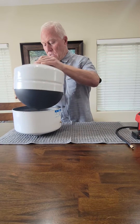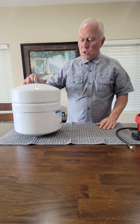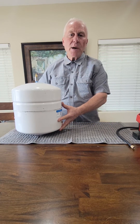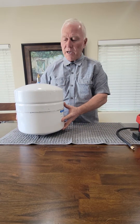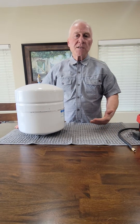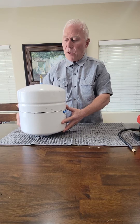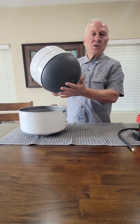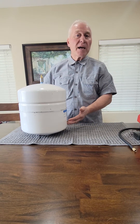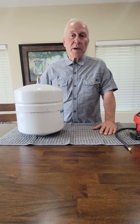But it needs a little bit of assistance. So when you're changing your filters, what you're going to want to do is adjust the air. This tank weighs 7 pounds without water in it. If you open your faucet and the water is running slow and then runs out, and you were to pick up this tank and it weighs 20 pounds, you'd be experiencing no air inside so the bag just sits there and holds the water. By having the proper amount of pressure on the other side, the bag gets fully depressed, and that's the best way to operate one of these tanks.